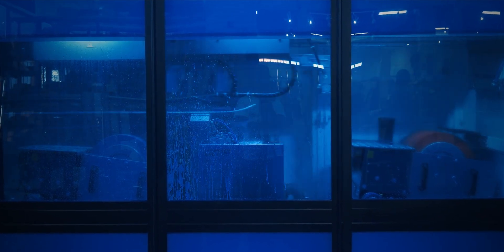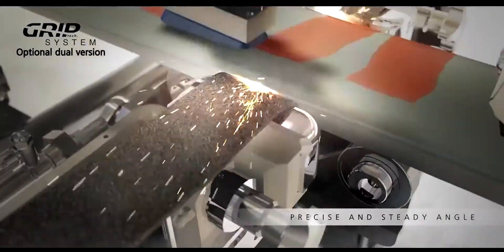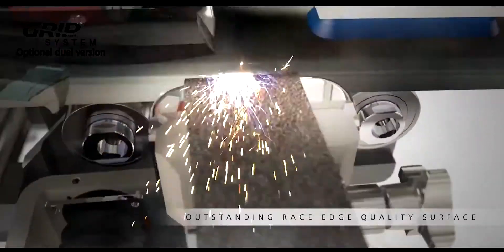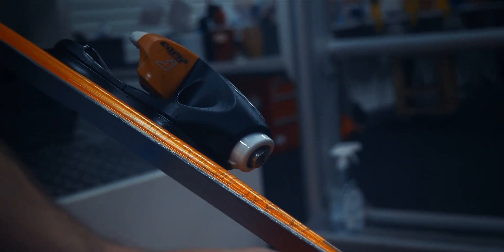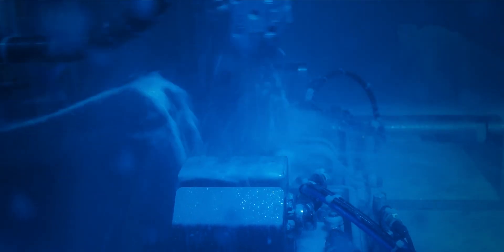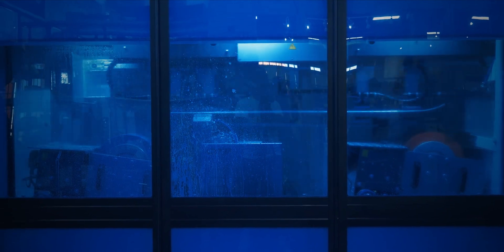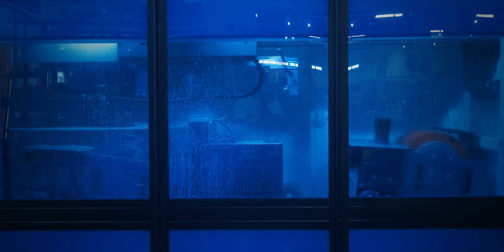Right now here it's going through doing the side edges, sharpening them up. The way it grinds vertically instead of horizontally produces these fine striations down the side of the ski — almost like serration but for the side edges. There are some machines that do it, but it's new for Montana, and it's just a lot better. GripTek is not common yet. From what Montana has told us, I believe this is the only machine in Canada that has this, and one of three in North America.